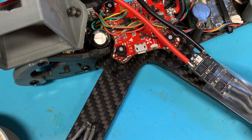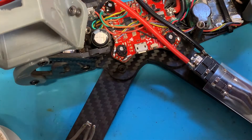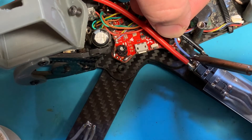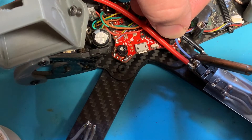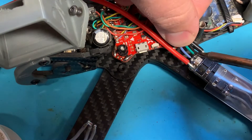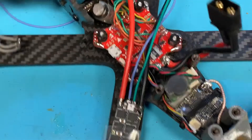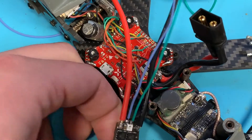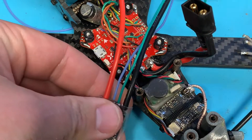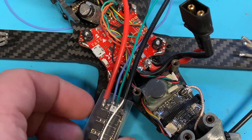With the power positive and negative side on, we can go ahead and get on our small little signal and telemetry lines. We don't need a whole lot for this. With all those lines on, we can slide up the heat shrink and shrink it in place, get our ESC in position, and then cut our wires exactly where we want them.